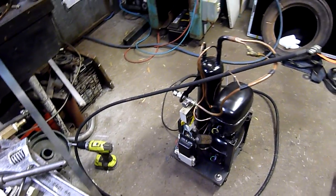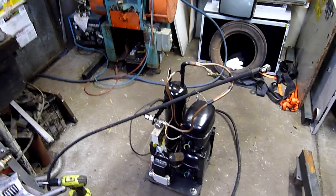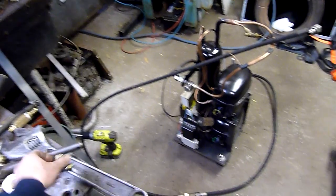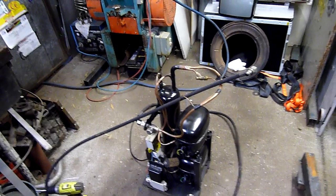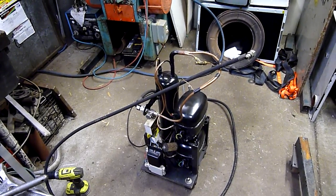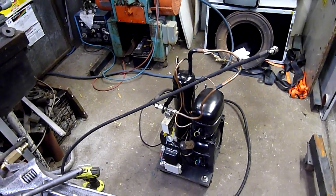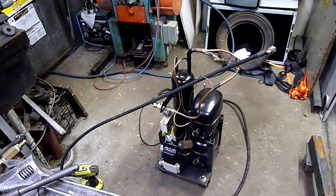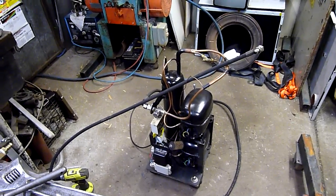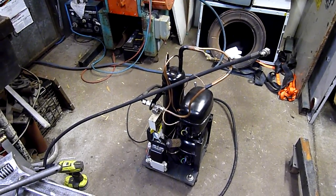Not much else to really say. I've got about 10 metres of hose for it now. All these Battenfeld hoses can be linked together with couplings like this one — that's a male to female right angle joiner and it works really well. You can crank it up to about 400 PSI all day long because the SC15s are designed for R22, they'll build pretty good head pressure and do it, although they'll have a bit of trouble at 400 PSI and you don't want to run it too long — they just get too hot.